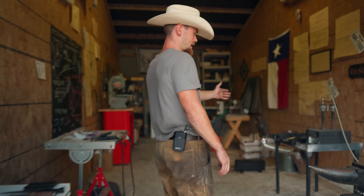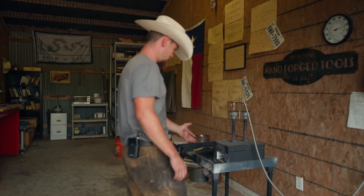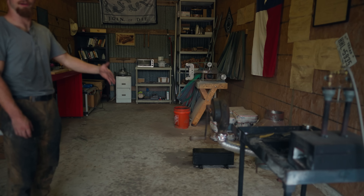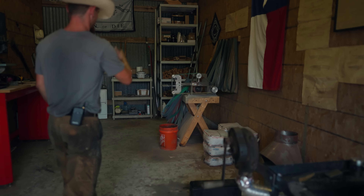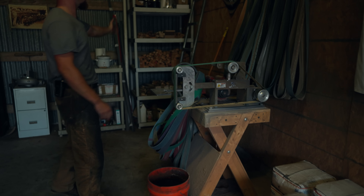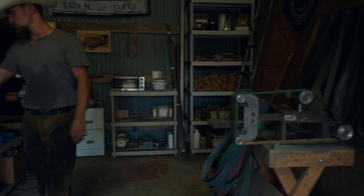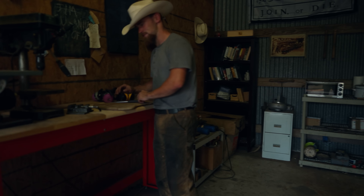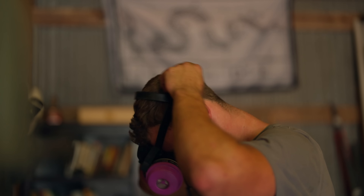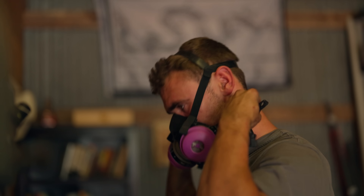Last night we got the hot work done. We got a big coal fire going and banged on the steel until we had the shape we wanted. We quenched it in oil, made sure it got hard. And then from there, we're going to move on to the grinder, make sure everything's nice and clean and consistent, then get a handle on it, do some woodworking, make sure everything's sanded down nice and smooth, fits good in your hand. Then throw an edge on it, make sure it's nice and sharp.